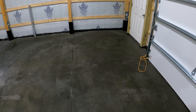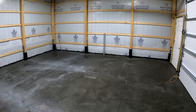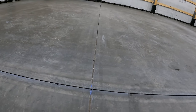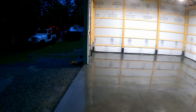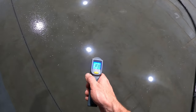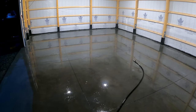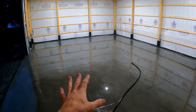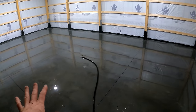This side was that loose slump, so I hope the PSI is going to be alright. There's not much I can do about it at this point. I feel like the second load probably should have been sent back, honestly. A couple hours later the severe weather is gone. This is fully hardened so I can keep the door open now. The concrete was getting toasty - it was up to 95 degrees before, it's at 86-87 now. The ideal temperature is 50 to 90 degrees for it to cure properly. I do plan to wet cure this - if you can keep it wet for the first seven days it can be twice as strong. Since we had a looser slump, anything I can do to get the PSI up, I will do.